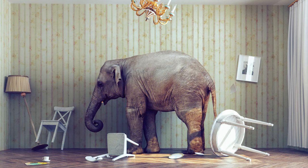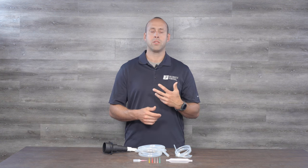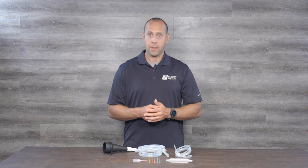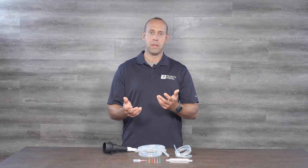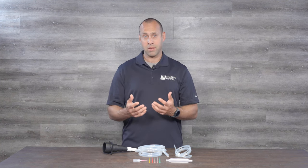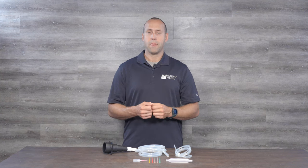Let's address the elephant in the room concerning vacuums, and that is the risk of explosion. There's been a lot of talk within powder coating circles about this, and the gist of it is that if you don't have an explosion-proof vacuum that is specifically designed for dry powder, there is a risk of explosion. And this is true — powder coating, like most fine powders and dusts, carries the risk of explosion if it's ignited. Even powdered non-dairy creamer can ignite and flame up. So it's certainly something to be aware of, and you should have a plan in place for these hazards. Simply put, a vacuum can be an ignition source, so just like many other things in the process, you need to assess your situation and equipment and have a plan in place.